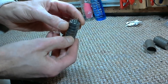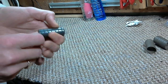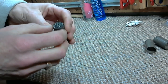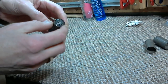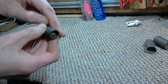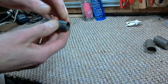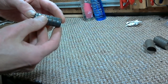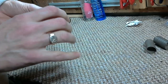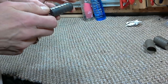This one's got a tube in it. How do you get the tube out? It's not so easy that you can push. You start pushing on the tube, you have to grip the tube shield, and you're just basically gripping the tube through the tube shield. So there's two things you can do. First, you can kind of just move this a little bit to make sure it's not rusted tight. See how that's moving there? And the other one is, the way you twist the tube as you pull it out will either tighten the shell, the shield, or loosen it. In this case, going this way will loosen it ever so slightly.